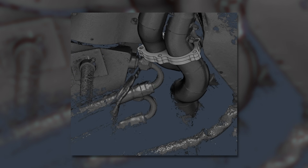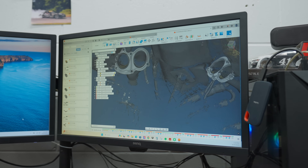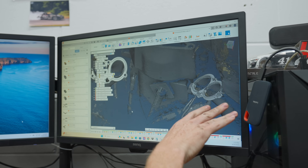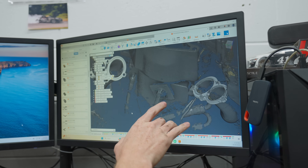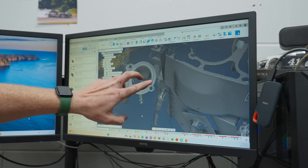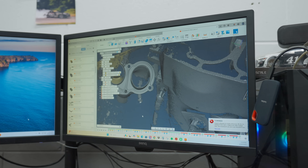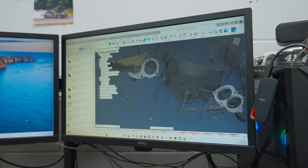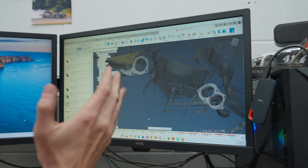It's just a pretty advanced project, honestly, almost because there's nothing square, symmetrical, or any data you can reuse off of this. On this one I then designed these two gaskets that we're going to be putting in. I'm going to cut a bunch of these — I really hope they're able to seal. We'll probably plane both flanges nice and square and flat. I had to add a bunch of material because I'm not able to get a hole up here due to the block, so I made this part of the flange much thicker in hopes we'd still be able to clamp and seal it. All of this is really trial and error — I'm definitely not an exhaust flange expert. Going into this project I was less than 50% confident I'd be able to achieve this.